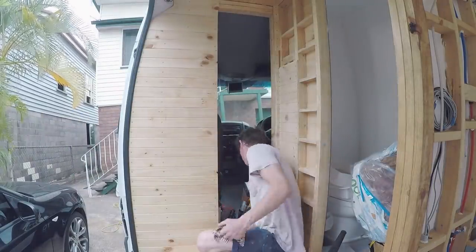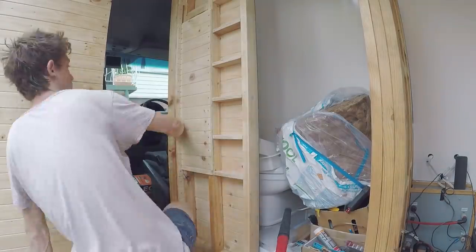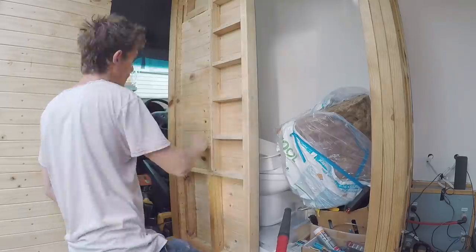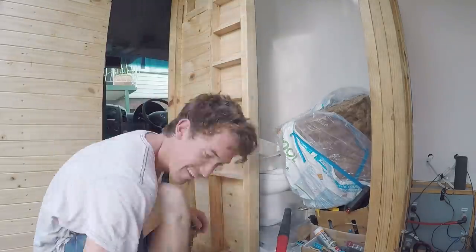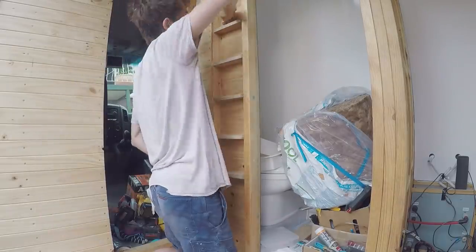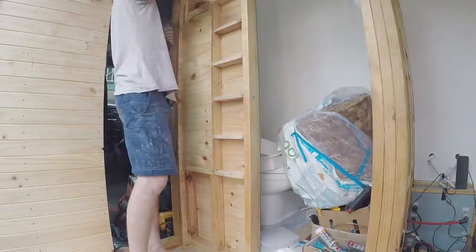So basically getting smoother and smoother towards the end of the coats. And you can apply however many coats you want, it depends how dark you want it. Danish oil doesn't go heaps dark. It sort of just makes the timber have a nice pop to all the grain. So I applied four coats, I was happy with it and happy with the smoothness of the timber.